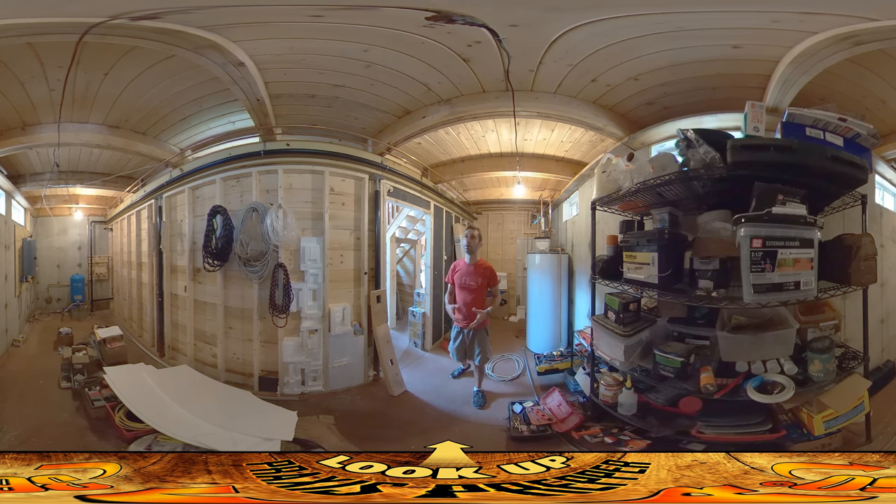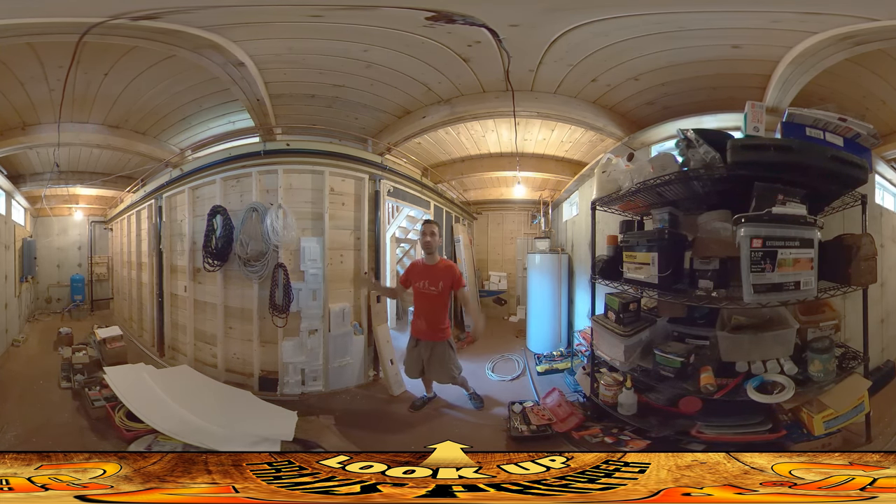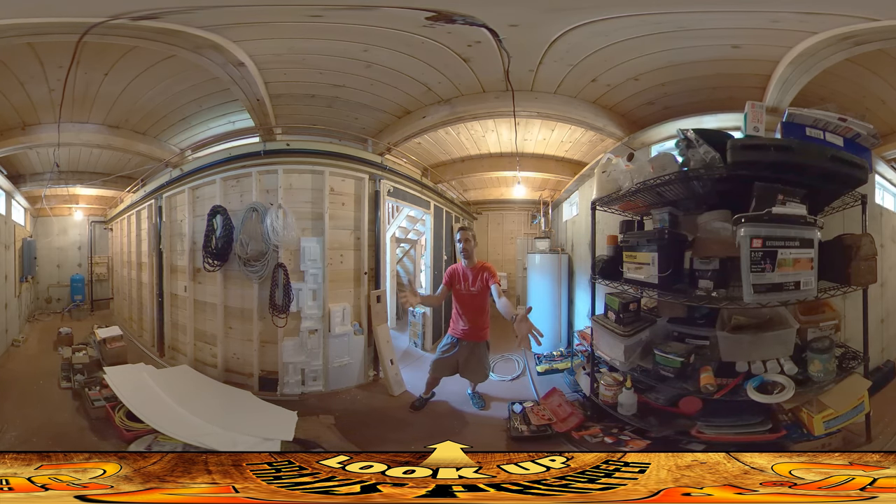That was the reason I did that, but the result is that the energy audit firm doesn't really know how to deal with it — people don't really do that kind of thing. So they're treating this environment as absolute uninsulated outside temperatures, as though it gets 10 degrees in here, which it totally doesn't. Because of that they're saying you need four inches of insulation on this wall to protect you from 10 below in the middle of winter, which is never going to happen.